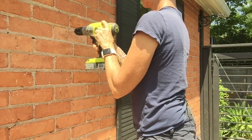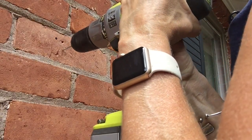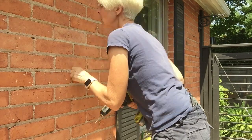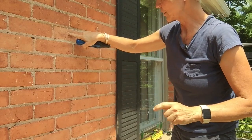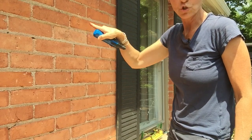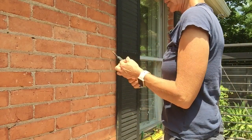Make sure your drill is level, then blow out any dust. When you're drilling into the brick, make sure that you drill straight in and straight out — don't wiggle — otherwise your hole is going to be bigger than you want it to be.